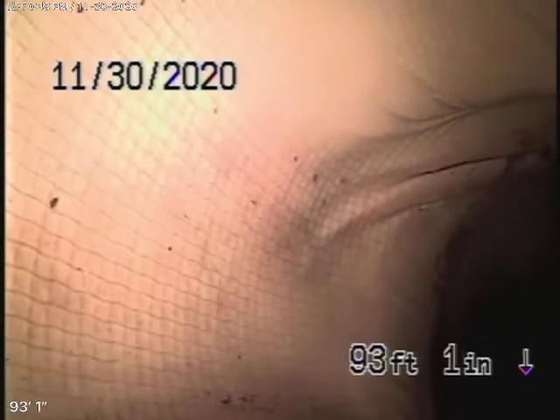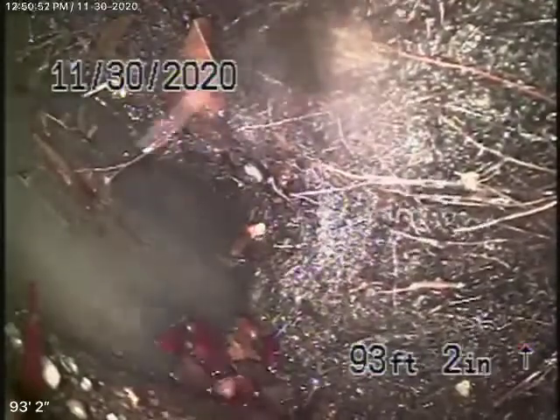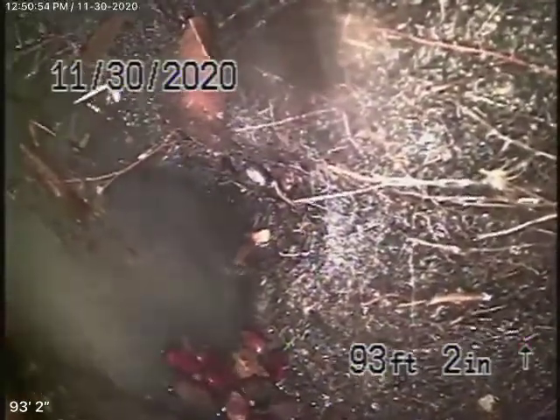There's the connection to the city. It looks like somebody did a cured-in-place pipe lining over here. You can see the roots have come in through the lining at the end of the line. These linings are basically a temporary fix — when heavy tree roots are present, they don't really stop the roots from growing. Running a cable with a blade will destroy the lining, and running a hydrojetter continuously will break the lining as well. The pipe needs to be replaced.